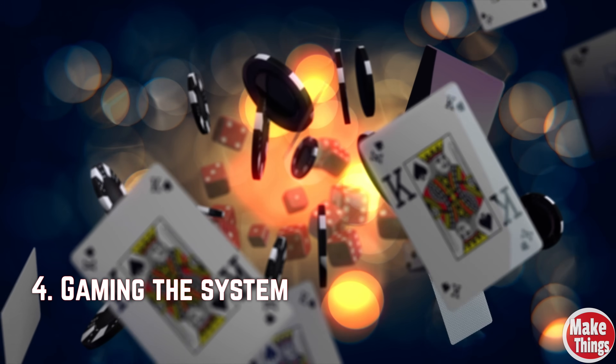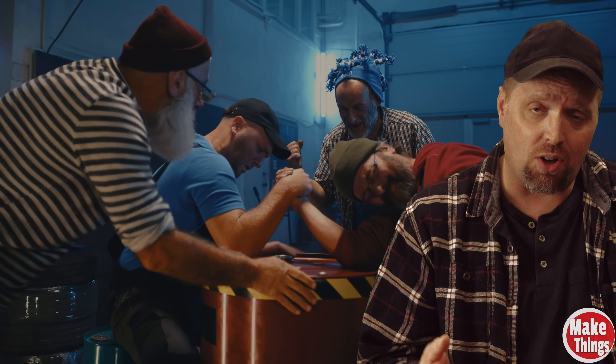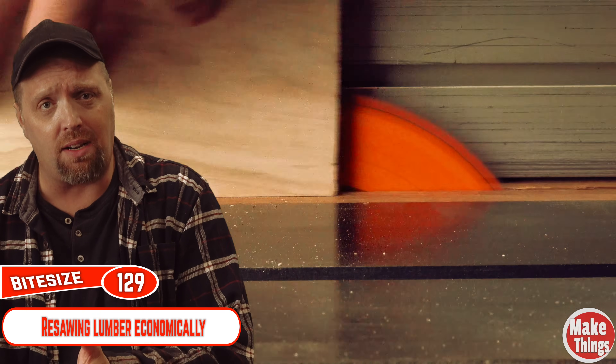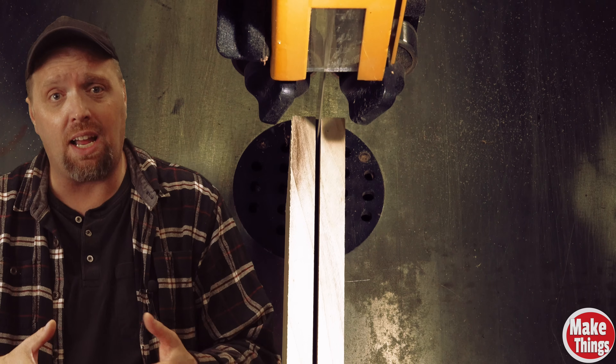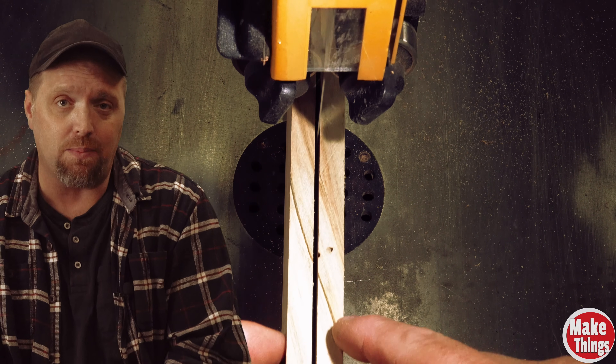Now that we've found the reason for drifting, what can we do to stop this? Obviously, the only way to keep a bandsaw blade sharp is to not use it. But to prevent blade drift, we need to make sure that we aren't putting excessive pressure on either side of the blade, prematurely dulling either side. There are a few things we can do to make blades last. As I've mentioned in bite size number 129, starting on the table saw and hogging out both sides with an inexpensive circular saw blade before bringing the stock to the bandsaw helps. This is how I do nearly all of my re-sawing.